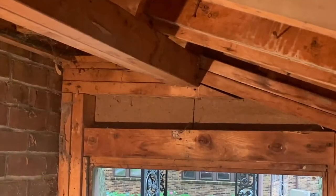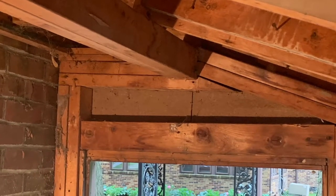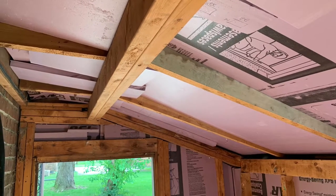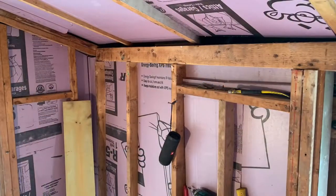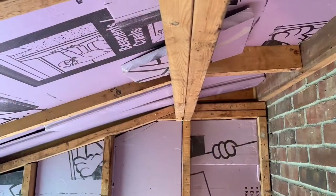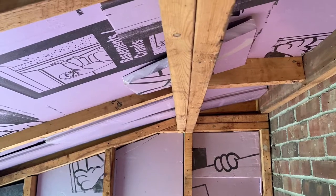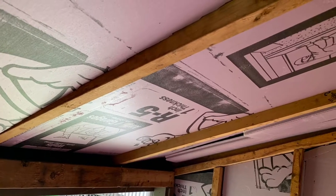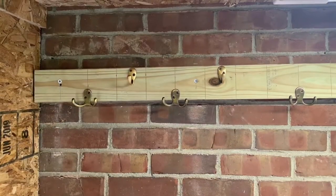This doorway and door frame — well, the entire building — because of the plates being rotted off, I jacked it up, squared it up, lined it up, fastened it all back up, put the insulation all up, and then proceeded to start cutting OSB to seal it up.